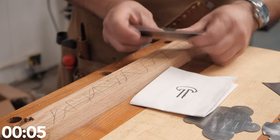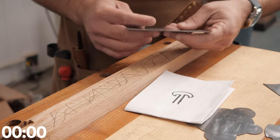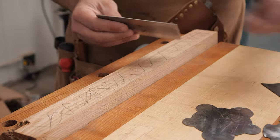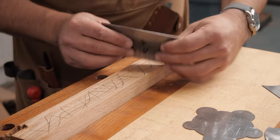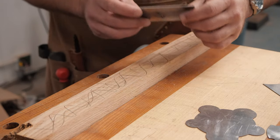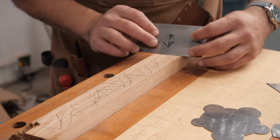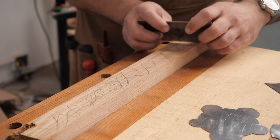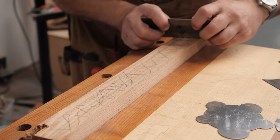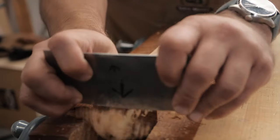What you want to do is grab it with your thumbs on the back, and you don't want to push super fast because this will heat up — it can kill the temper on your metal as well as burn your thumbs. Just put a slight bend in it; nothing too extreme. The less bend you put in it, the better finish across the piece. Hold the card scraper at about a 10 to 30 degree angle and adjust as you go to find the spot where you're getting shavings. I drew some pencil on here to show you how fast this works.